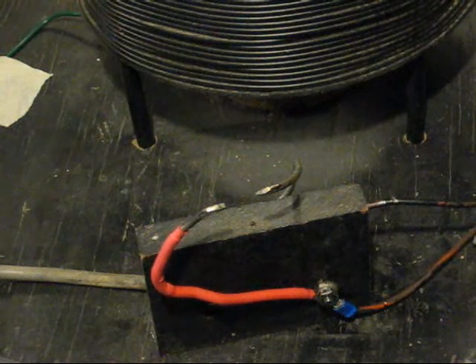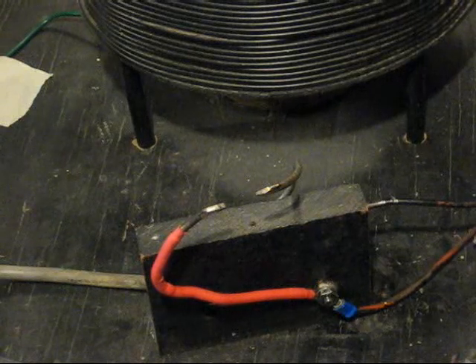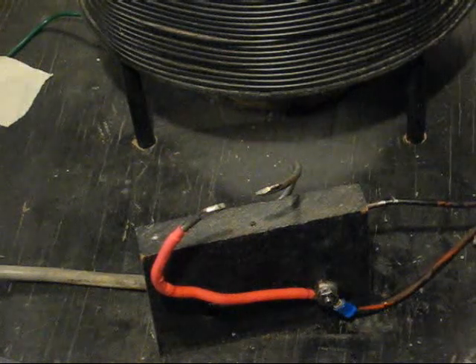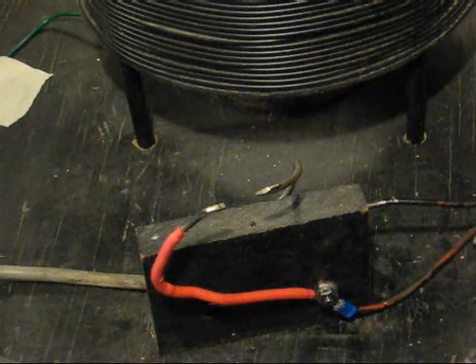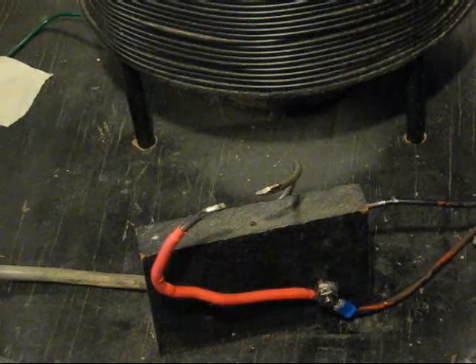You can see that the spark was intensified by the presence of the air passing near the gap. I think what that's doing is actually allowing the capacitor to charge to an even higher level because I'm tearing away the ions that are being produced near the gap.